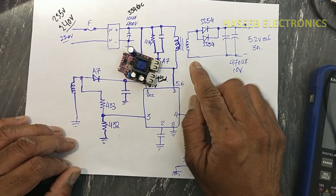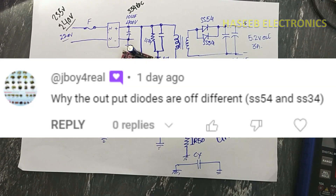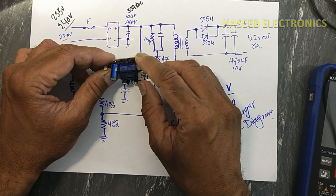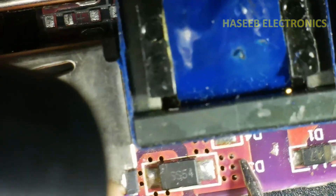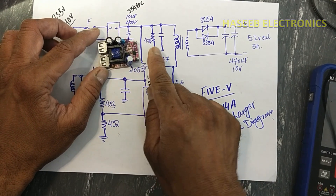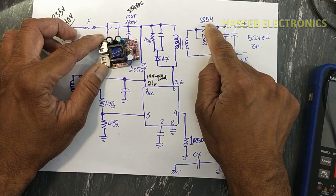Welcome back to my channel. In the last video I shared the diagram for this mobile charger and I received a very logical question from my viewers: why is it using SS54 and SS34 diodes in parallel? When I was making the circuit diagram I saw these two diodes — SS54 and SS34 — under the transformer, with the anodes of both diodes connected together. I did not remove the transformer then, but now we will remove it and verify this statement and the diagram, and then see why these two different diode numbers are connected in parallel.